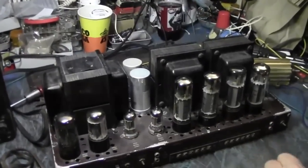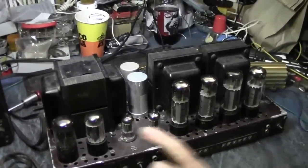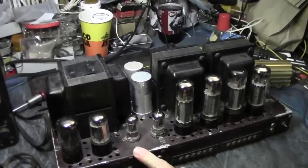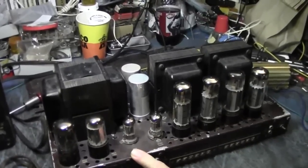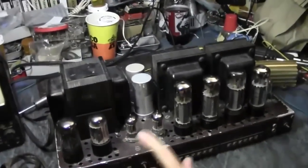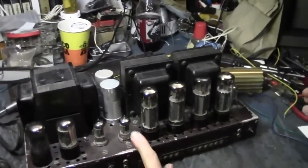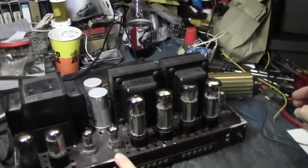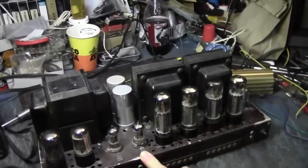And there's another funny thing on this. This has a double triode preamp acting, they're in parallel. And they really should have used a bigger tube. But they've got a triode driving a DC coupled phase inverter. Right, now what is this, the 50s? This is stereo, so it has to be the early to mid 60s.